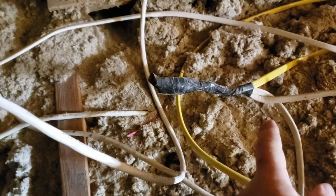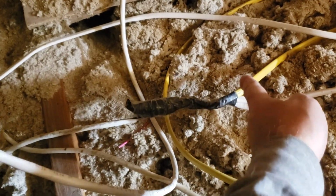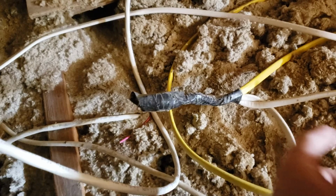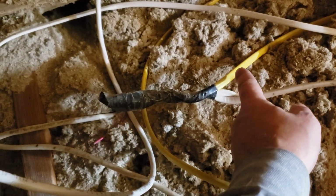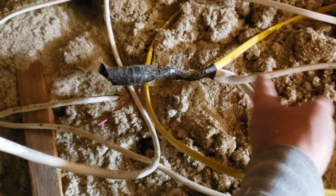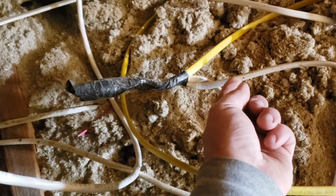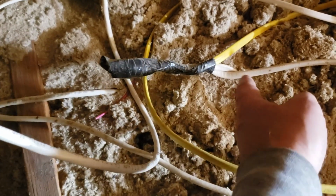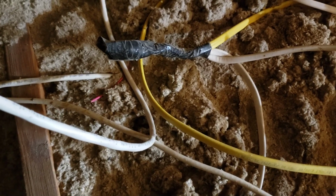If you're doing any electrical, never trust that the person before you did it right. And this 20 amp line here, this 12 wire could be running back to the panel, and I could go into that panel and see, oh, there's 12 wire, so I'll go ahead and put a 20 amp breaker on that, or change circuits or something. You don't think a person would run that and then splice it like this into something like that, and then you have a fire hazard right here. This wire becomes your fuse. If you were ever to pull more than 15 amps on one of these lines, or between both of them, you end up starting this on fire. This stuff melts down up here. So you just have to be really careful, and just never assume anything.